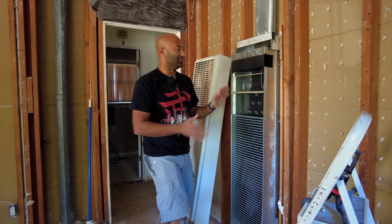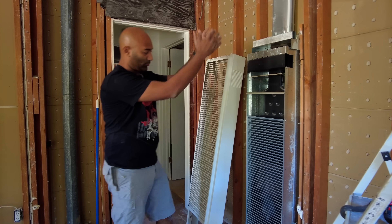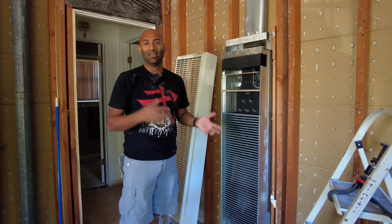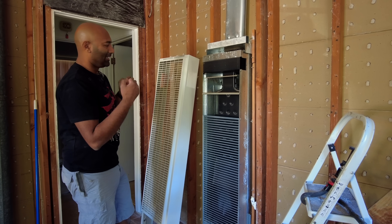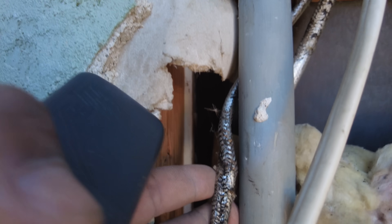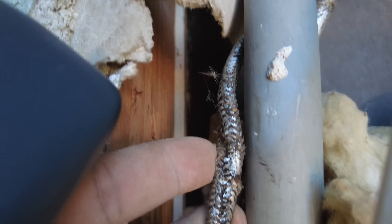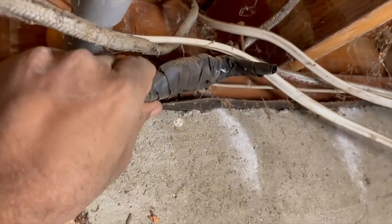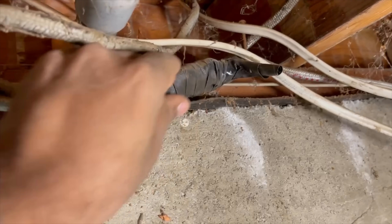Part of building the most sustainable home is getting rid of all the natural gas. This was the heater we had before, and Brim and Juan complained that when they ran it in the winter, it gave them a headache — so I think there's just maybe a little bit of a leak. It's old, doesn't really matter, we're ripping this whole thing out. Look at how bad this line looks — it's falling apart. This is just a fire hazard waiting to happen. There's a ton of absolute crap down here — like four different wire seams all butted up, not in a junction box, just wired up and taped.